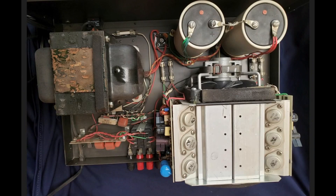Here is what the Hafler 500 looks like with the cover removed. The output devices are here — and there are some on the bottom as well — and they're FETs. You can see the fan, more fuses inside, two big capacitors for the power supply, and then the transformer. There are circuit boards on either side.